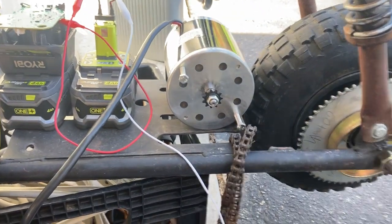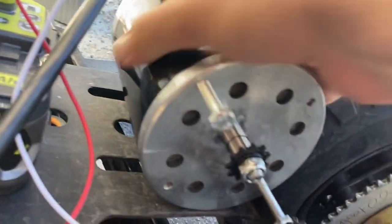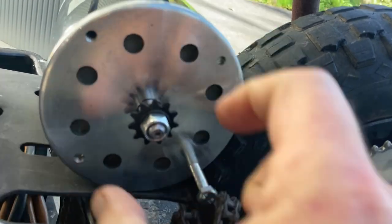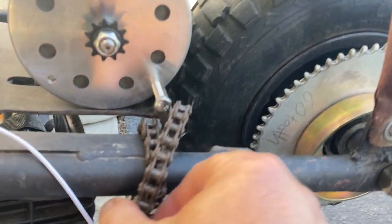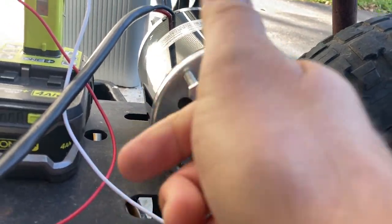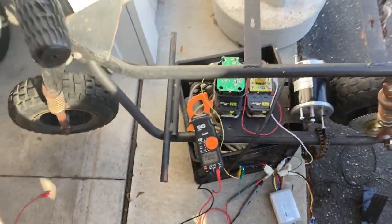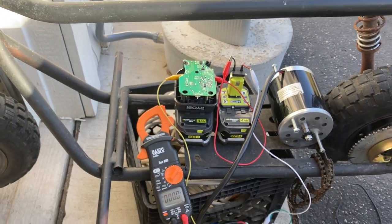The next thing I'll need to do is deal with a motor that didn't come with a foot mount — I really just wanted a foot mount and right now I have no way to mount this down. I'll probably have to fabricate some sort of face plate that connects in here. I've got a couple of M6 bolts in there, so I'll make a piece of steel with two holes in it, and I want to make it slide so we can adjust tension on the chain. Maybe if I ever get a free Saturday afternoon I'll finish this up and make a working little mini electric motorcycle — there's lots of space in the frame, so I'll have cargo room and everything.